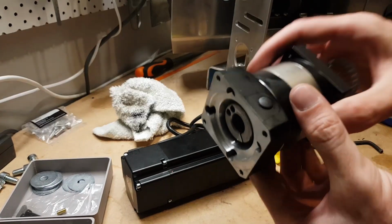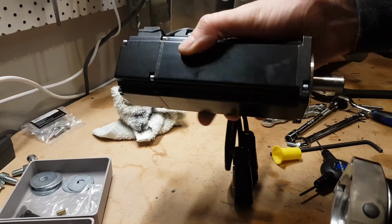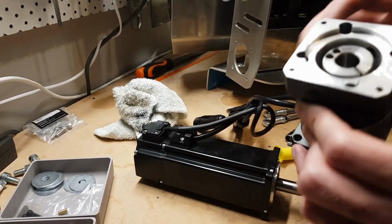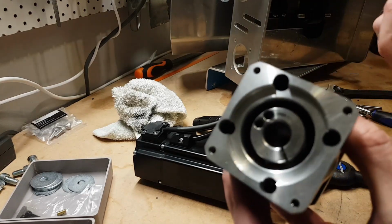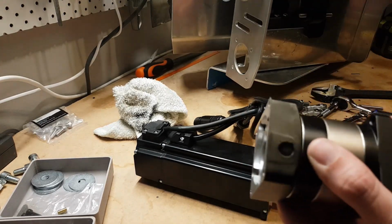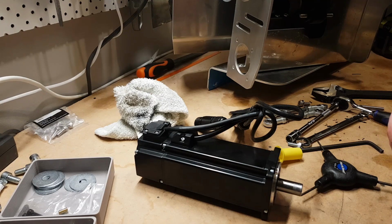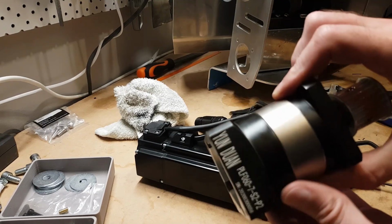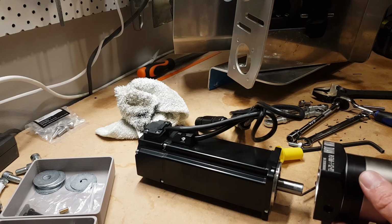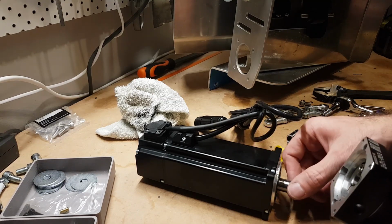And then, so gearbox mounts onto our lovely, tasty wee servo. So this is the S60 ST servo, but bit smaller than your regular 90 STs on the SFX platform. And so what it's got inside is a clamping collar, and you just take the plugs out, and this one's only got one hex Allen bolt in it. So line that up. Decide, very important, all these little details. So decide, do we want this to match up with that on that side so it's visible on the outside? I think we do. We can always change it later on.